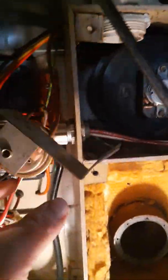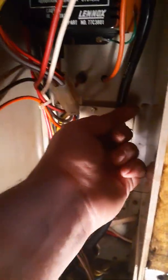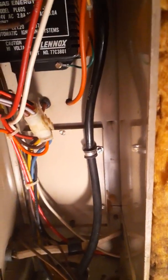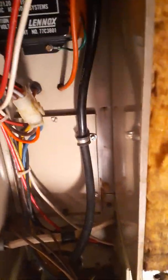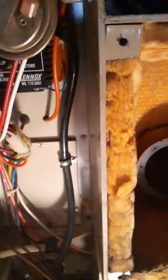There's basically a control panel there. I replaced the plug — you take this panel off, reach up in there, and right here is your spark plug and above it is your flame sensor. Those connections just pull right off; you unscrew them and you can replace those. So I did that and made sure my gas was on right here, then turned it on.